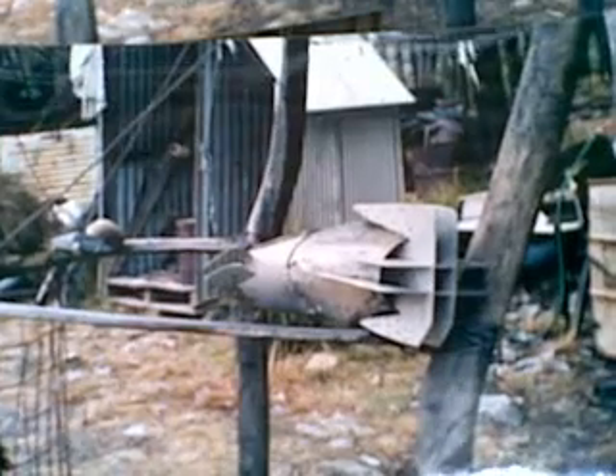At this point the only way to tell them apart from the outside is the pattern of the cooling airflow holes. On the fourth prototype they extend forward in a V shape, whereas the third prototype has a straight leading edge. This is possibly one of the maddest of my mad scientist projects — condensing second-hand used two-stroke oil from the exhaust flow of my backup generator. The figures show that 3.2% of the oil that goes in through the carburettor comes out dripping off the bottom of the exhaust canister, and a further 1.3% of what goes in the carburettor is being captured by this rig.